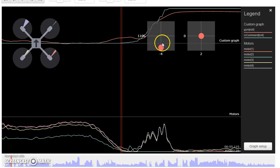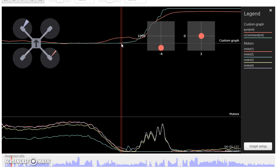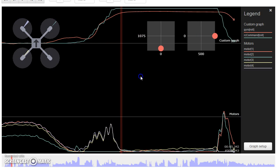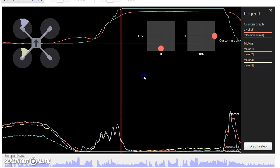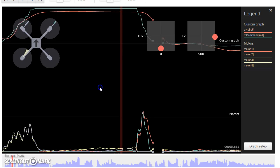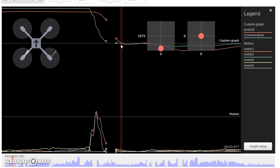And one of the things Boris pointed out was, so here we've got a low throttle roll with air mode off. And if we look, here's RC command and here's the gyro. And we see that the stick starts to deflect at about 5.127. And as the stick begins to deflect, full deflection is achieved. So let's take the time from full deflection. Full deflection is achieved at 5.3, and the stick returns to center, and the move stops. Let's see, there's the gyro there, right there. So 5.1 to 5.87, so we're looking at about 0.7 to 0.8 of a second, depending on how you slice it.